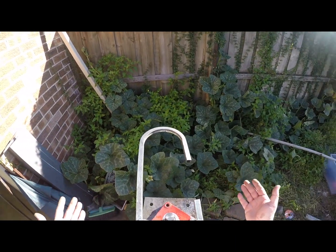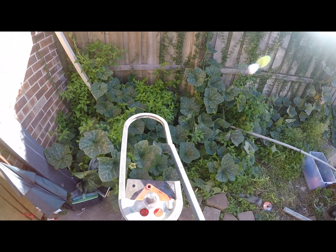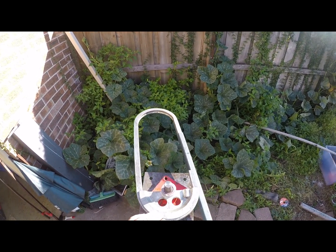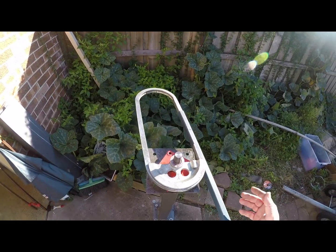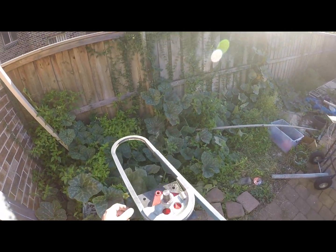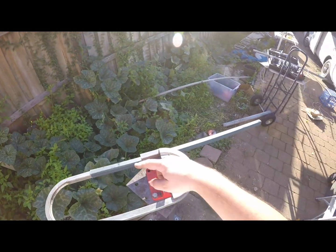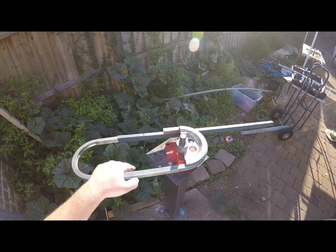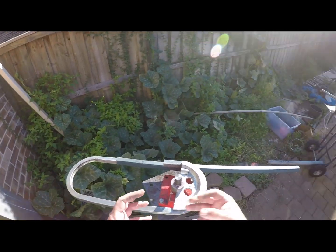I've put bars on the end here trying to get it out of the die, but basically you just keep bending it — you bend it this way and then you bend it back, and you lose strength in your material. So 150 degrees is what its maximum is. I could bend 150, but to get that 180 was really, really difficult, and it's in there so tight I can't separate them.